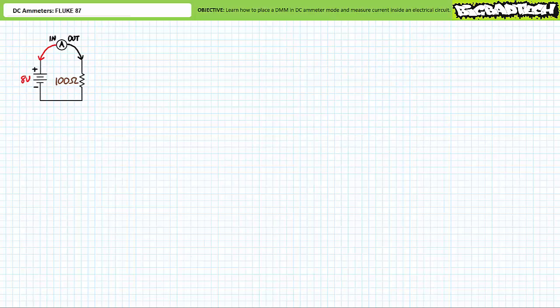Power off the power supply. Break the circuit. Insert the ammeter. By all means, draw a picture and talk yourself through it. Think how conventional current flows through a circuit: current leaves the positive terminal of the source, enters the ammeter indoor, travels through the ammeter, leaves the ammeter outdoor, enters the resistor, travels through the resistor, leaves the resistor, and returns to the negative terminal of the source. One and only one path where current exists such that the ammeter is part of the circuit and all current will travel through it. Build the circuit exactly as illustrated, step by step, and make sure one and only one path for current exists. Take your time and really think about it.